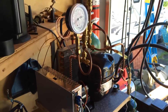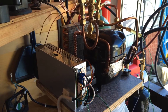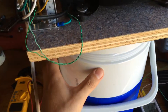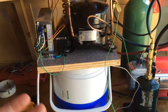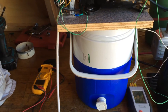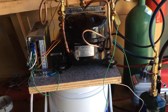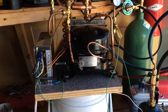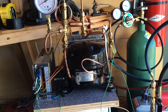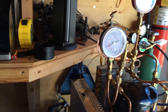Down the road, I'm probably going to cut a hole in the top of a small refrigerator and mount this thing in there, and maybe adjust the capillary tubing for air cooling, although that's not my long-term goal. I'd eventually want to just use a stainless steel bucket or pan of some sort and chill a coolant in that. I haven't specifically decided on a coolant yet — this is just ethylene glycol because that's what I had on hand. Toxic stuff, so I don't want to use that long-term. I might even look at alcohol. Eventually I'd like to build a small freezer in a modular setup like this — I think it would be neat to cut a hole and just plop this thing right in. Anyway, that's my modular cooling unit. Thanks for watching.